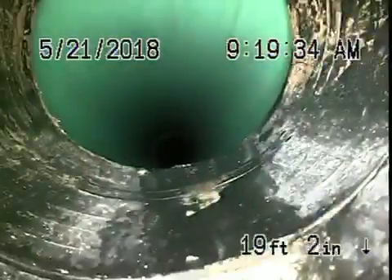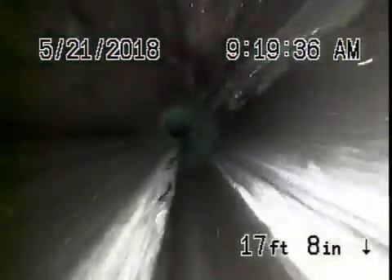Looks like we've got a pretty new pipe over here — this is all new. I think they did a pipe burst over here. You see that? This is SDR and it comes back to a little piece of SDR 35. This is all in good condition. It comes back to a four-inch ABS plastic, all in good condition.